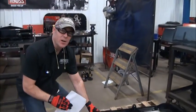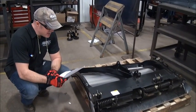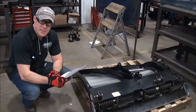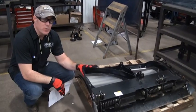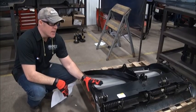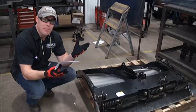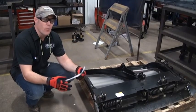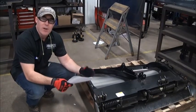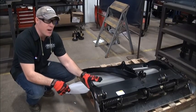You'll notice I have the blade sitting face-down on a pallet. The very first step in the installation manual says place plow blades on the ground face down — that is how we want you to install these plowshoes. This is the safest procedure. If the blade was fully assembled and in the upright position you'd have to get it up off the ground, and we do not want anybody under the weight of that blade.